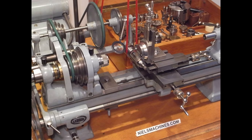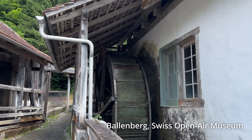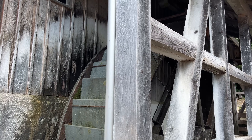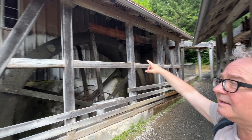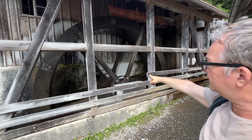This all goes back to old Swiss power systems that were mill driven. You would have a factory that had a water mill, literally in a river, providing rotary power into a factory setting. Then you'd have all these pulley systems throughout the factory distributing that power to all the different workbenches. This is how factories were powered back in the day. It doesn't take that much water to create the weight to turn this, and once you get inside you can use that rotary power to drive belts and all kinds of machines.